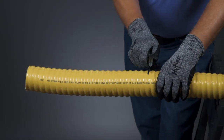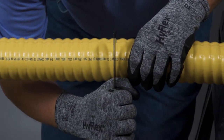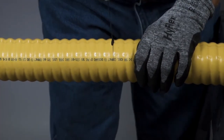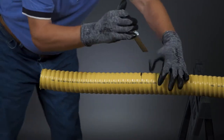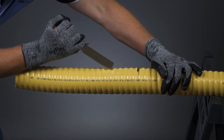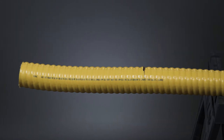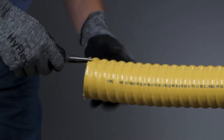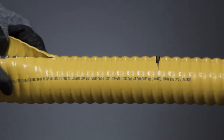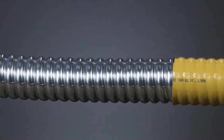Using the splicing knife, make a ring cut circumferentially around the jacket at the mark identified. From this ring cut, make a longitudinal knife cut parallel to the cable to the cut end of the cable. Using pliers, lift the cut end of the jacket from the sheath in order to separate it along the knife cut and remove it from the CLX armor. Take care not to rip the jacket at the ring cut, as doing so may affect the environmental seal the gland and jacket provide.